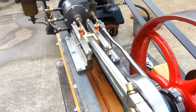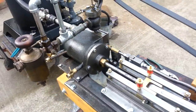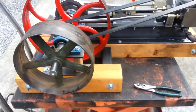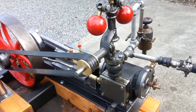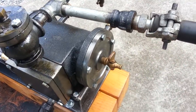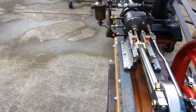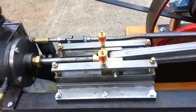I machine all the parts. I have the castings done — the only casting on it is this one right here, that I machine. But everything else, like this old flywheel here and this one, came off the internet. And I machine all the Flyball Governor parts. There are some antique blowdown valves here, and these little oilers that are on it are from a model making company.